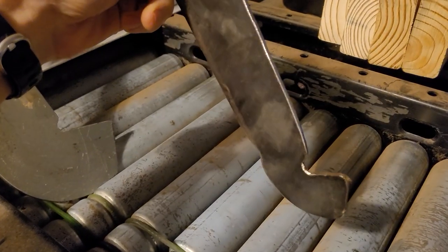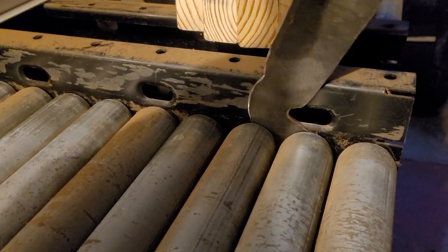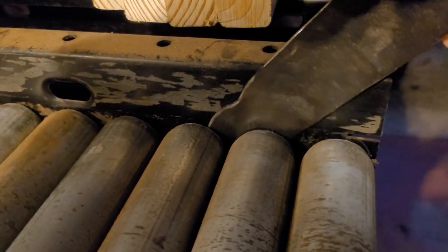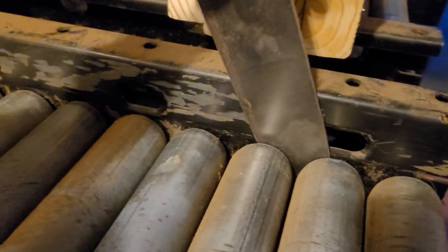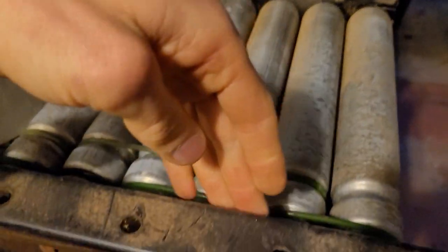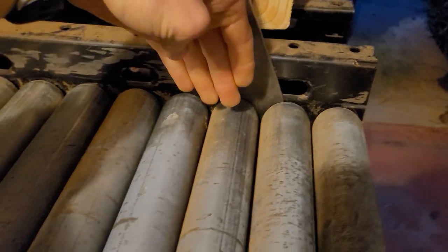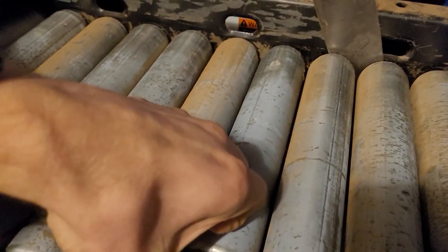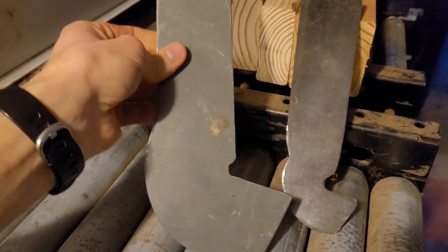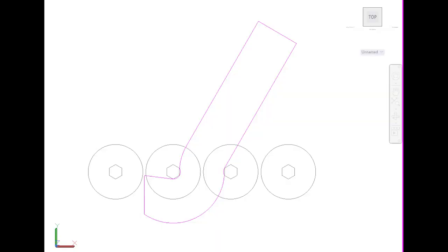Here's a flat bracket you would use to rig up one straight bed section. It's designed for rollers on two-inch centers, so it goes down between the roller shafts and pivots back at a 60-degree angle. You might have to offset one slightly to get the slop out between two different rollers, then it pivots back out. This size would be for rollers on three-inch centers.